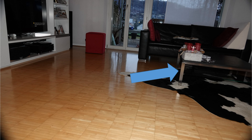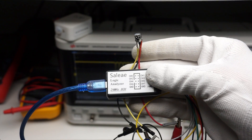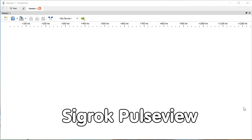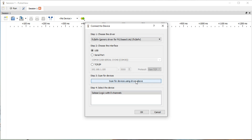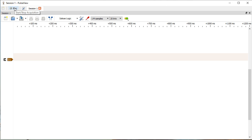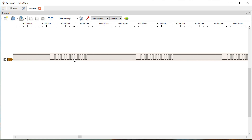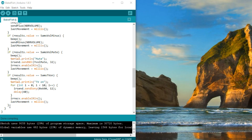A first test showed that the TV did not react to my device. I checked again and did not find the issue. I had to go one level deeper to the bare metal. To do that, I connected one of these GPIO logic analyzers to a VS1838B receiver and fired up Sigrok, an open-source logic analyzer software. Sigrok clearly shows the issue: even if I only press the Sony remote button for the shortest time, it already sends the same code four times. So I changed my sketch — now my device also repeats the signal a few times, and the TV switches without issues.